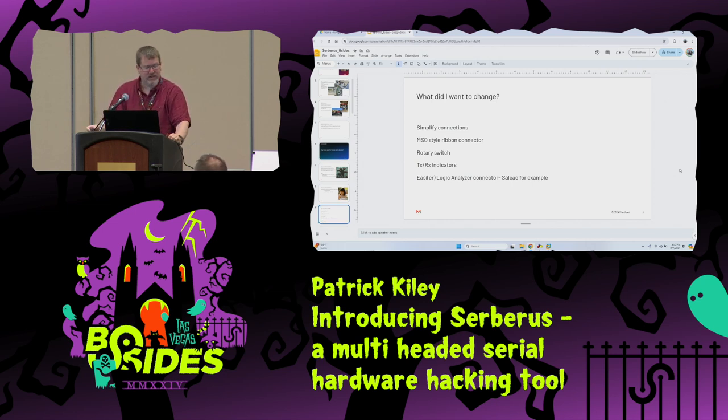Some other things that I wanted to change, I wanted to simplify the connectors. I wanted to use an MSO style ribbon connector. If anyone has ever used a mixed signal oscilloscope, they have the little 20 pin IDE connector that breaks out into 20 separate pins that you use to connect to your logic device. I wanted to have that simple connector on it. And then also the Segger, which is a very common and professional level JTAG debugger device, has that same style of connector. I also wanted the ease of connecting up a logic analyzer.